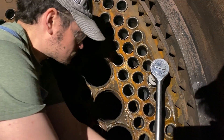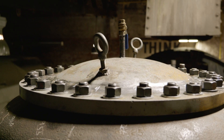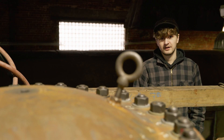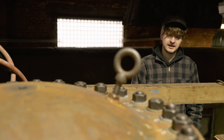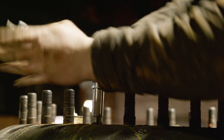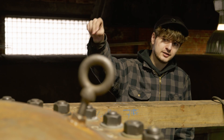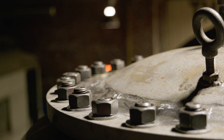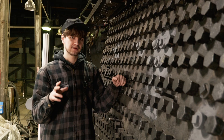As we showed you last month, the steam dome is now fitted with a new lid. Upon our first hydrostatic test, we found that one of the studs on the dome had some thread damage and couldn't seal properly. With that, we pulled that stud out, tapped the hole to accept a new stud, and machined up a new stud and put it in. In addition to that, we have a new copper gasket that has been crushed down under the torque of all the studs to make a nice tight seal.